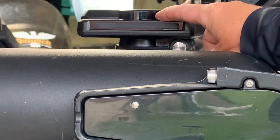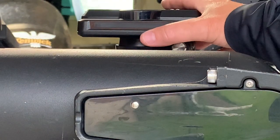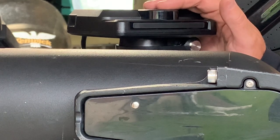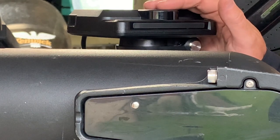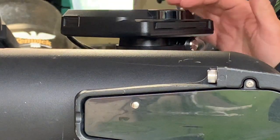You can see the Mega Down Imaging Ultra X is here, and this is where the signal is coming from on the transducer. In down mode it's shooting out in all directions. When I start to click — remember 10 degrees per click — one, two, three, four: that is now in standard forward mode. A lot of people are finding 50 and 60 degrees better for showing bait coming through the water, especially in shallower water. I believe 60 degrees is going to be the optimum range for this tournament.